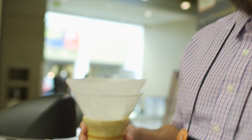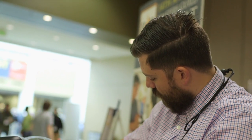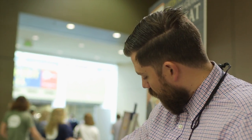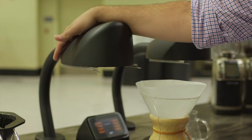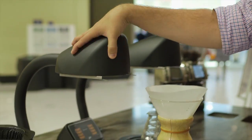So this is nothing more than a fancy batch brewer. The components used in this brewer can be found in all of our other equipment. We have the brains of a Gold Cup brewer with the Generation 4 technology, the brawn of our five gallon water tower, and we use the pump out of one of our other coffee brewers made for office coffee. We sell about 7,000 of those brewers a year, so we know this pump works really well. The only component we had to create for this brewer is an atmospheric chamber within this head — there are no moving parts, it's completely non-mechanical, so there's no real way for it to fail.